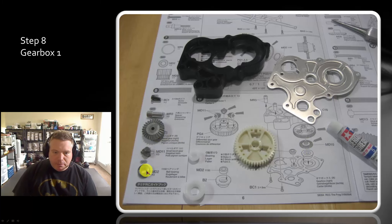Then we have our bevel gears and more ball bearings. These ball bearings come with the kit — I haven't gone into any extra ball bearings yet. You've also got to cut these little plastic bits out, get the center part of your gear housing, and get the right half of the gear box. These are stamped metal pieces. If you flip this over, you'd see an R, so make sure you're using the one that says R. And then you also need your grease.